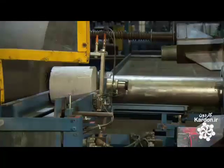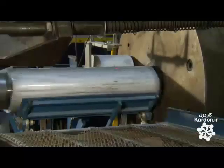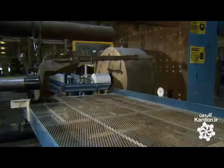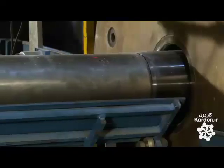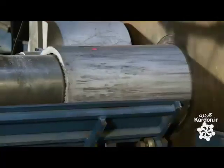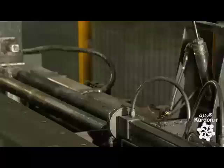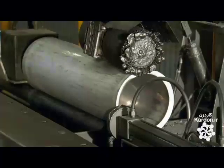An extrusion piston forces the slug into a die inside the press. It hollows and stretches the slug into the shape of a scuba tank. It takes about 1,300 tons of force to transform a solid short chunk of aluminum into a longer hollow cylinder. The shaping process itself generates heat, making the aluminum softer and more malleable. The press establishes the outer diameter of the tank, the inner one, and the base. The process takes just 20 seconds.